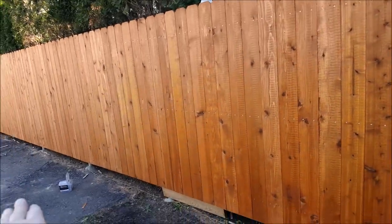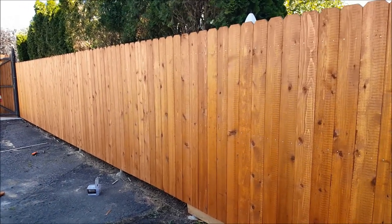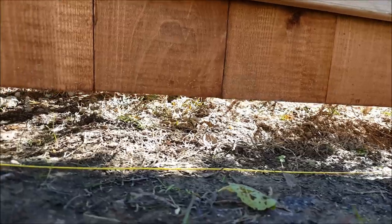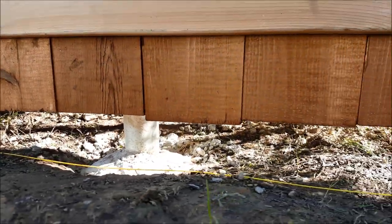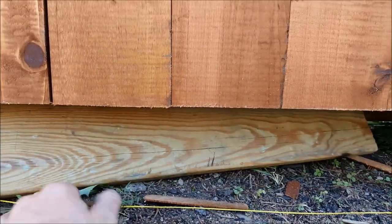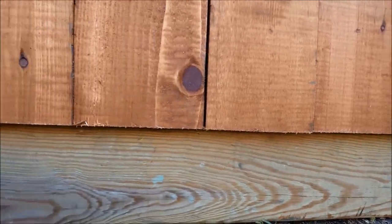However, these pickets came in varying lengths by up to about 3/8 to 5/8 of an inch. Instead of cutting each picket individually, I decided to just trim them all off at the end. You can see all these little scraps here — here's a section I hadn't done yet with varying lengths. That's a minor detail, but I'm going to be bringing the grade up and placing a 5/4 board along the bottom, so you would see those gaps. Where I've already trimmed it, you can see it's going to look nice and flush.